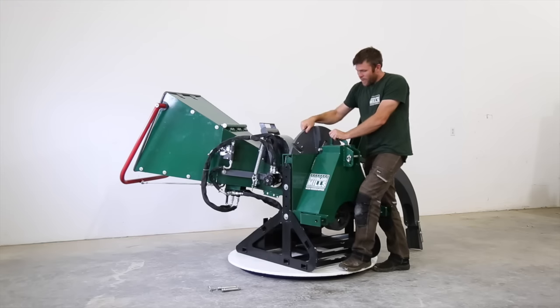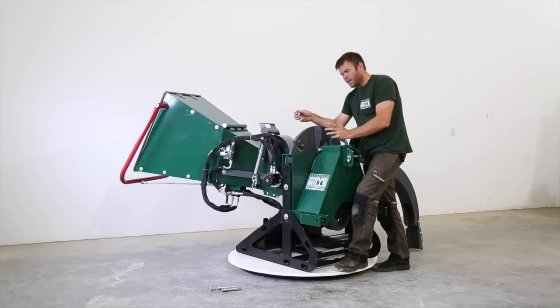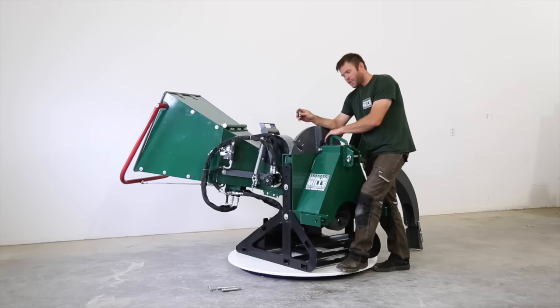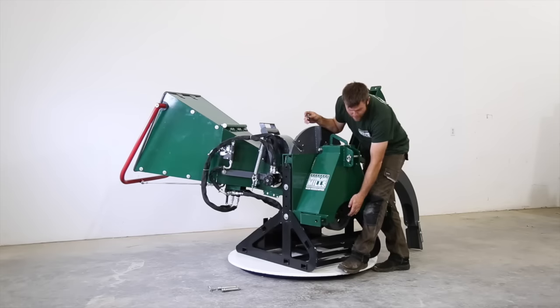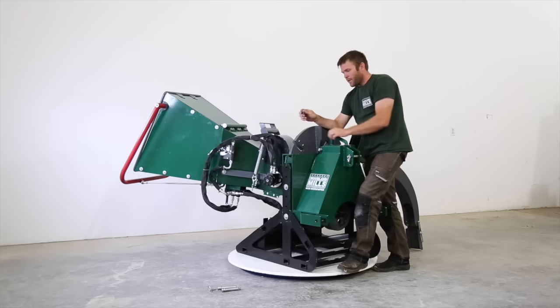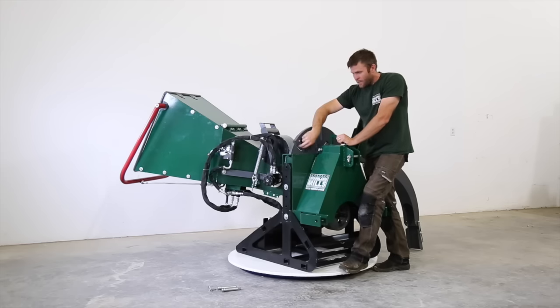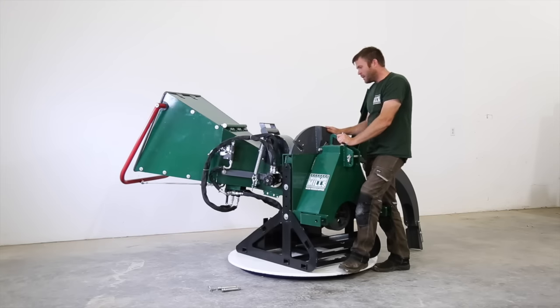On the back of this flywheel, it's 120 pounds solid steel. Some manufacturers quote their total revolving weight, which is flywheel plus shafts, plus pulleys, plus, you know, primary drive pulleys. We're quoting the actual weight of the solid steel flywheel. So a 24-inch diameter plate of iron at 1 inch thick weighs 120 pounds with the tabs on the back, which basically make up for the machining pockets for the blades themselves.